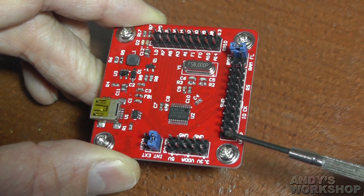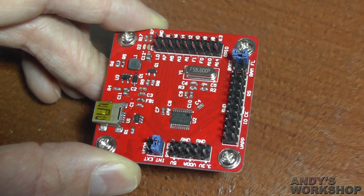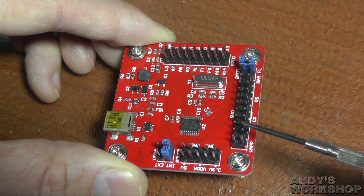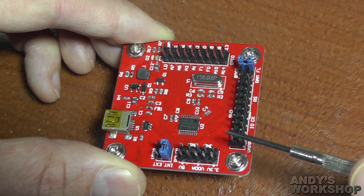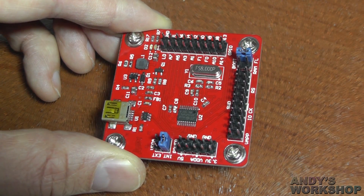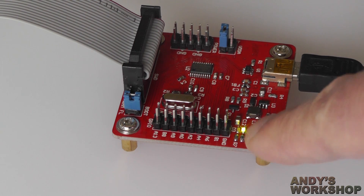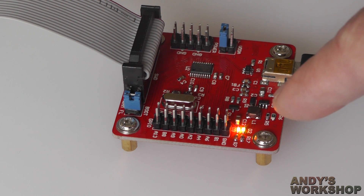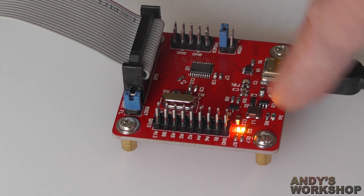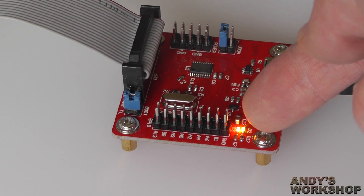That concludes the walk around. It's a very simple board and I'm very happy with the results. I've been using it to debug a USB device and I'm quite happy so far — certainly happier with the board than I am with ST's USB sample code, which is pretty awful, but I'll work on that. Please visit my website, have a look at the write-up, and maybe build one of your own. The classic blinky test: I've got the onboard LED flashing here. It proves the MCU is programmed correctly, GPIO is working, the SysTick timer providing the one-hertz flashing is working, and the internal clock is set up correctly — a lot of stuff proven out by one little flashing LED.